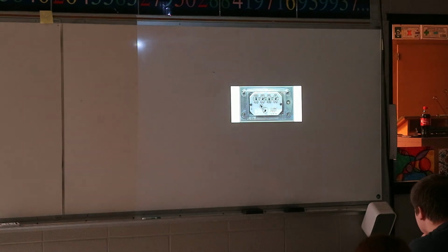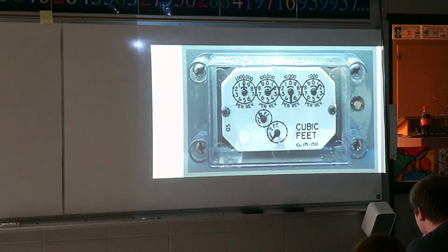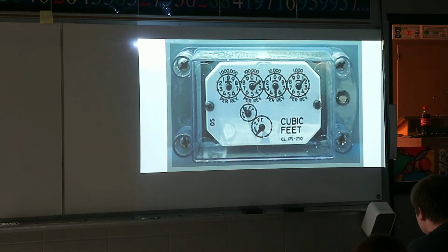Next one. I don't know if I can zoom in on this one. Same thing. It's a 4 dial, so they're probably checking it every 3 months. So this number, can somebody read off what that number is going to be? 1, 2, 5, 1. 0, 1. Yeah, that's what I meant. 0, 1, 5, 1, or 0, 2, 5, 1. Just depends if that's actually on 2. I don't think it is, but yeah, 0, 1, 5, 1. That's just how you read it.